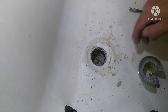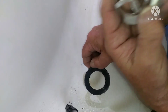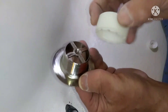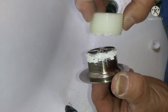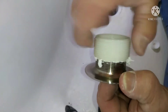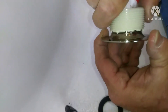Get that all cleaned out and get the pipe cleaned out as well. Here's the new one — unscrew the top part and you can see the crossbars in there. That rubber gasket usually goes underneath. I can't get underneath, so I'm going to do all the waterproofing from above and reuse what's underneath. That actually has an extra threaded piece, kind of a universal fit if you've got different kinds of threads. So I opt for the liquid Teflon. I'm going to put it on this ring first and screw that extra set of threads on there, not leaving anything to chance as far as any water getting in there.